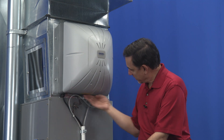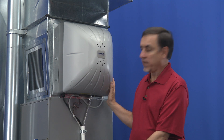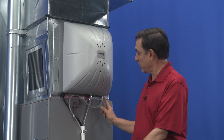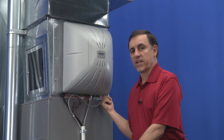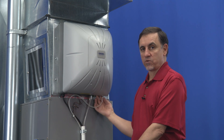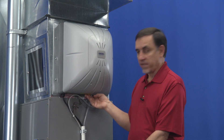So if you have water leaking down here underneath this, or water leaking into the ductwork, the first thing you want to look at is these connections up inside here. We want to make sure that the water connection going into the solenoid valve and also going out of the solenoid valve are tight and not leaking. You're going to want to dry them off with a rag and then look at them and make sure that there's no longer water dripping out of those areas. If you still have water leaking at that point, then it is something else going on.